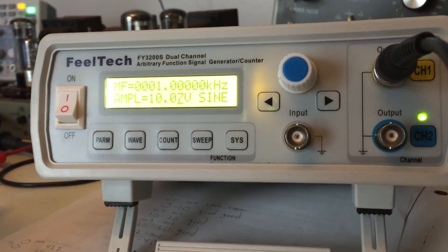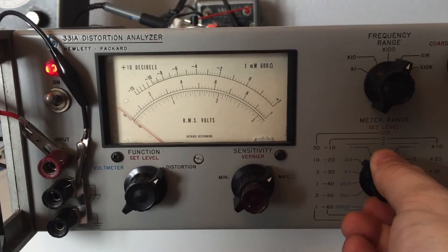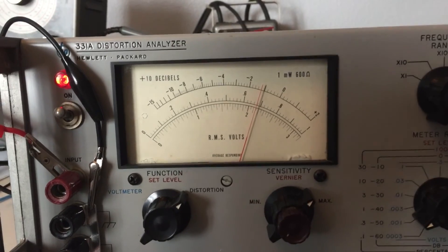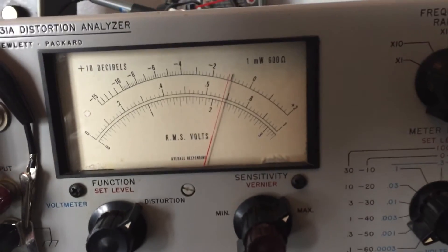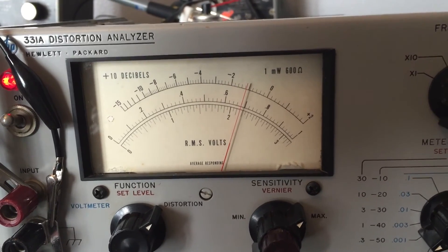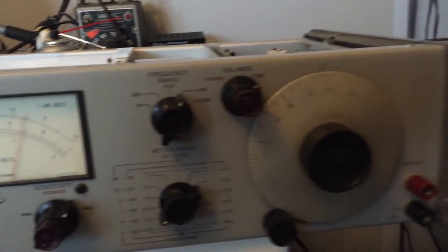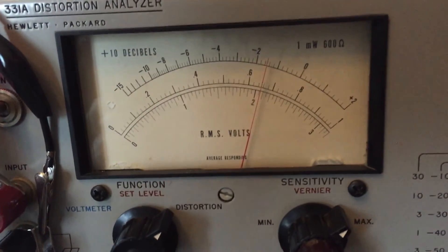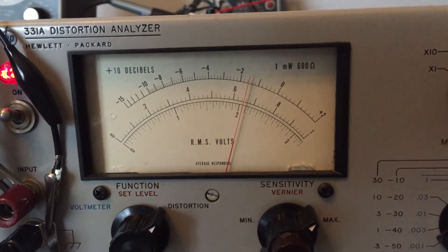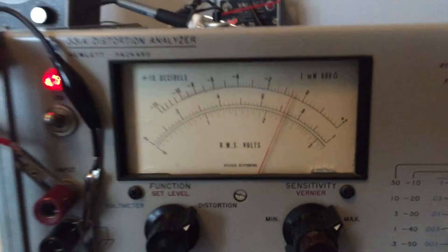Using that as the standard, I measured other frequencies. At 5 kilohertz, that brings us down to 0.215 percent total harmonic distortion. 10 kilohertz also shows 0.215 percent. 20 kHz shows 0.21 percent. 30 kHz shows just over or just under 0.21 percent. 40 kHz shows just about 0.25 percent. 500 hertz shows just under 0.223 percent total harmonic distortion.